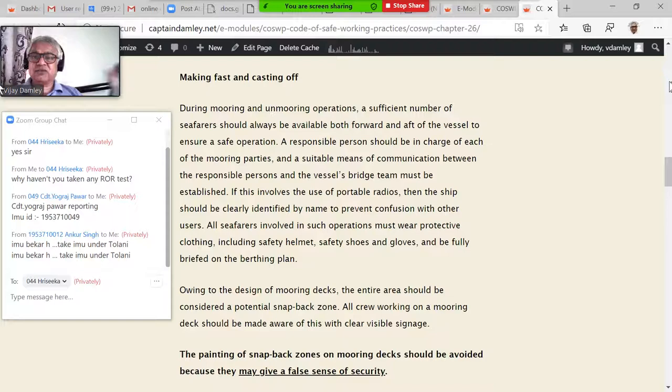Don't stand a chance. Now, what happens is there are proper leads. The rollers are there. You just follow the same path. Then suppose you are heaving on a warping drum, or on the normal storage drums and the tension drum. There, with tension drums, it is easier. As you heave, you just tighten the brake and declutch it.